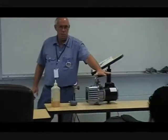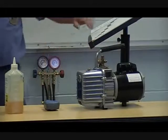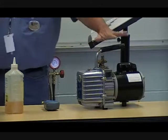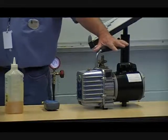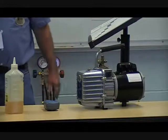In order to boil the water off — which is what you're doing by lowering the pressure — you've got to get down to the lower microns. A regular vacuum pump won't do it, and a converted compressor won't do it. You've got to have a two-stage vacuum pump, one made to get down into those low microns. The capacity of a vacuum pump takes into consideration two things: can it pull a deep vacuum, and how much volume can it pull? This pump is fine for most residential and light commercial work, and can even be used in heavy-duty applications, but for a large system with a lot of volume, you need a pump with more capacity. This is a series-type vacuum pump.